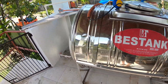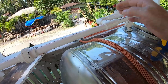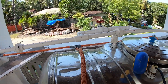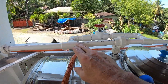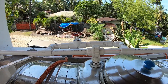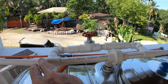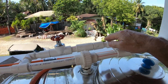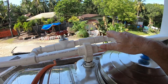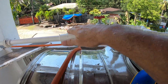Just to get us to have water, I also need to raise this up because this here is about three inches lower than this — that's why you see it down here. Another problem: in my infinite wisdom I figured this bypass would go all the way through, so I'd shut this tank off. Wrong. Water takes the path of least resistance, just like electricity does. It's shut off here, but what it's doing is going through here and back in there. I'm going to have to put a one-way valve in here so that can't happen.